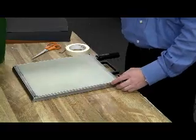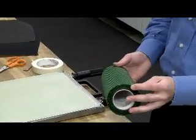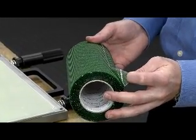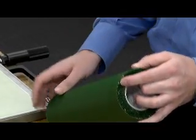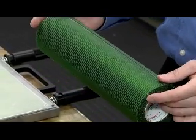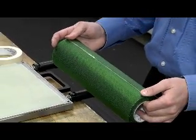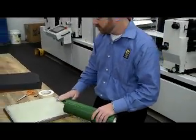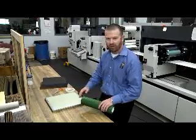Another way to apply it is with double-sided tape. This is a product called Duploflex Full, and it's very sticky, very tacky, but it's clean as far as coming off of any of the products that you've applied it to. It's about 4 thousandths thick. It's ideal to know that whenever you cover an entire area with a double-sided tape, you know what your total sandwich is, so that you can make certain that your make-ready is ideal and is uniform all the way across the bed.